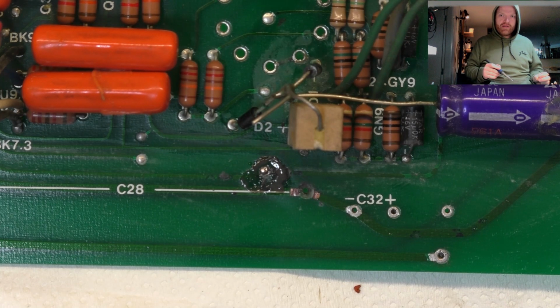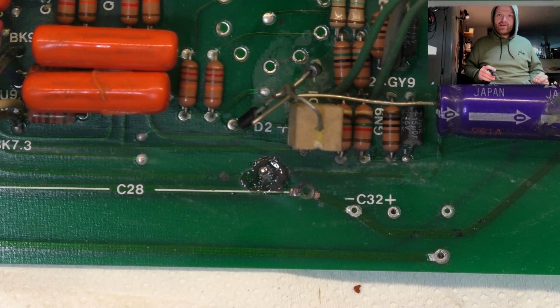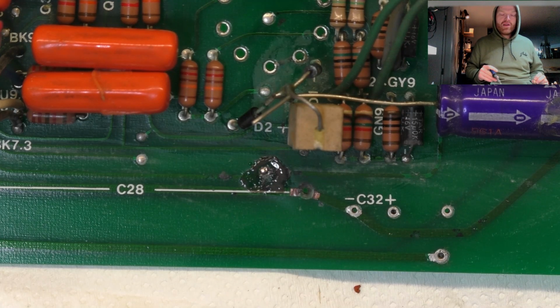If you're working on your own amp, you take full responsibility for that amp. You can't blame it on some bloke on a forum that told you, oh, WD-40's fine, or whatever. You have to do your due diligence to be able to know 100% what you're using is certified for use in an amp. Don't spray anything on the valve sockets, ever. There is no magical spray that you can spray on a valve socket and make it magically better.